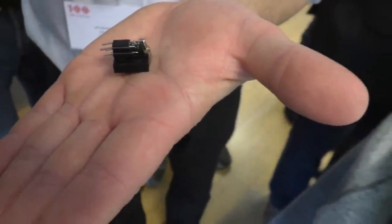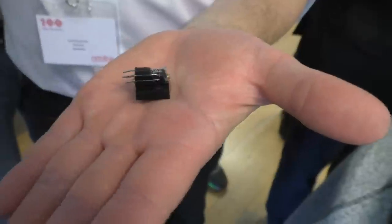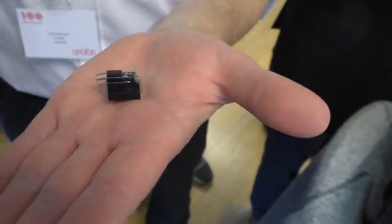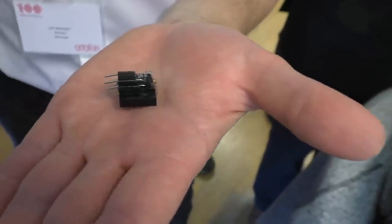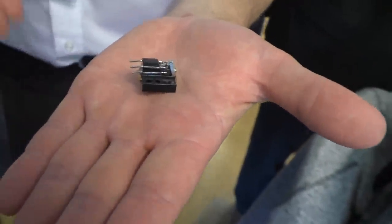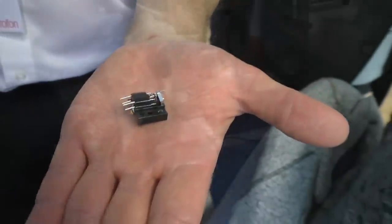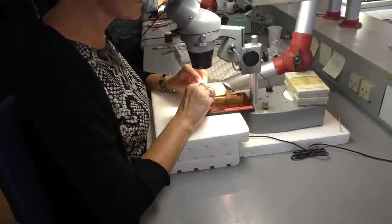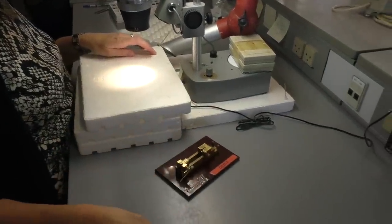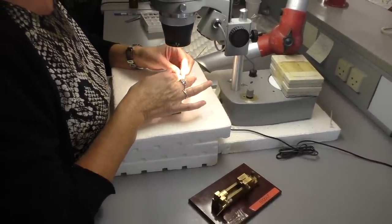But it's important with the SPU to remember that the housing, the properties of the housing, also is important for the SPU sound. Big resonance factor. So if you listen to a naked SPU unit, the sound will be different from if it's mounted in the housing. So the armature has been wound before this, but this is just assembling different parts. And you can see we have dedicated fixtures for the different processes to control the position of the parts.